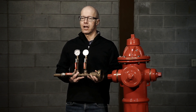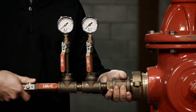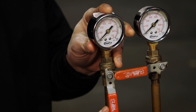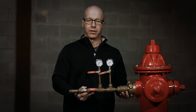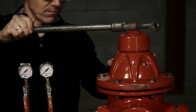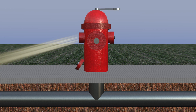Attach the device to the hydrant nozzle. Close the ball valves to each pressure gauge. This will reduce the chance of getting dirt in the pressure gauges when the hydrant is opened. Slowly open the hydrant using an operating nut, allowing flow through the other side of the nozzle. Flush water through the device through the open end. When the hydrant is first opened it will discharge some colored water from the service lateral line; after a short duration the water should clear.